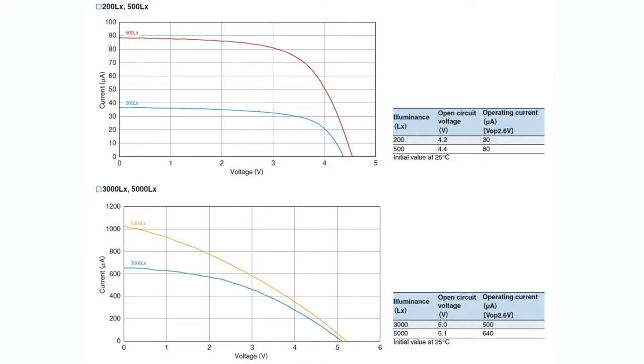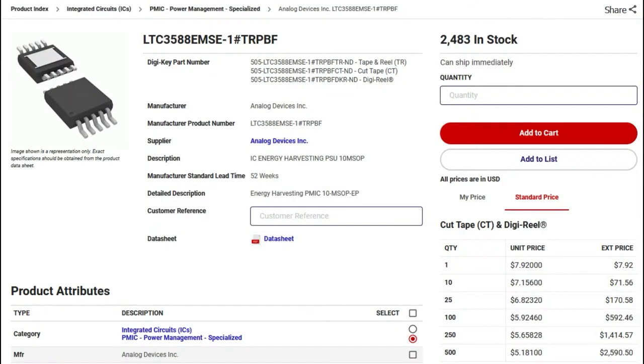When it gets to a certain voltage, it turns on your circuit, and then it runs. That can be good for IoT where a little sensor lives in a room. It only has to send the temperature or humidity data every 10, 15 minutes. So it slowly charges, 30 microamps at a time, charging up the supercap. The supercap gets to 3 volts or 3.5 volts, whatever. The circuit turns on, depletes the capacitor while it's sending that data over a radio, and then turns back off.